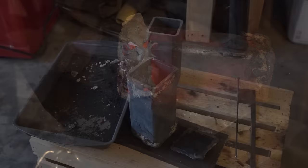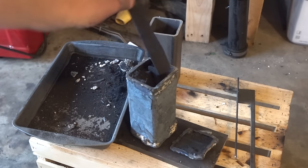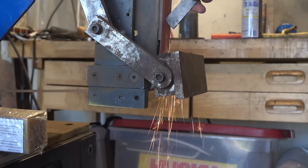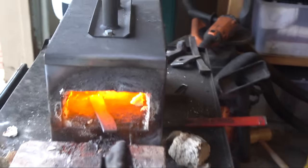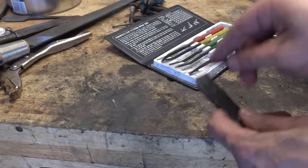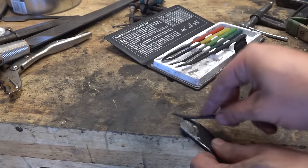Starting a second batch, this time baked for only one and a half hours instead of four. The original process didn't adequately account for oven heat-up and cool-down time. Spark testing this batch shows it's still pretty bursty, with fewer sparks than the over-carburized batch—suggesting this is on the right track.